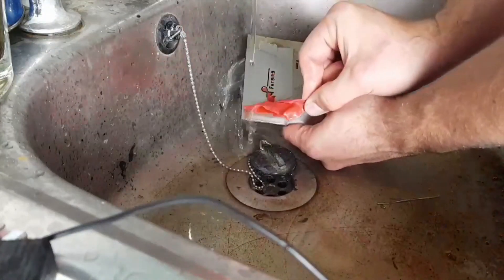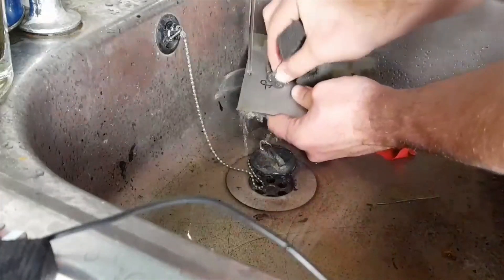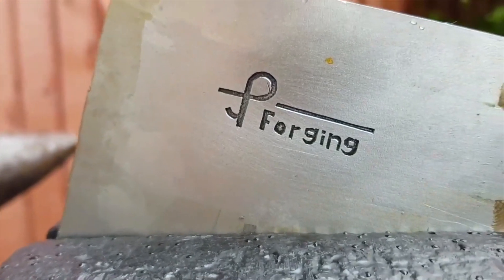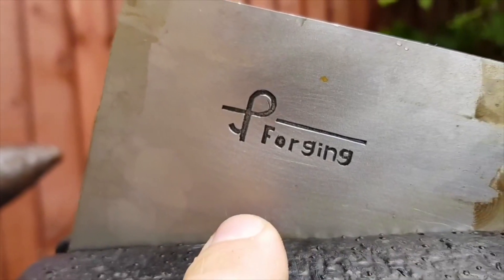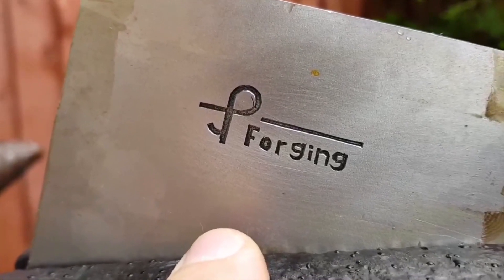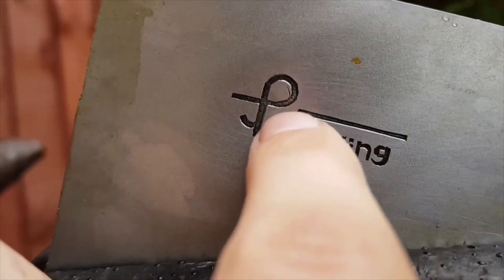I was quite impressed with this — I think it came out really well, considering it was a bit of a botched job. We got rid of the last bit of extra tape, gave it one last clean, and I gave it a quick scrub with some Scotch-Brite. There you have it: one pretty much spot-on example of electrochemical etching. I had originally planned to make the template using a vinyl cutout, but I couldn't find anywhere that would do it particularly cheap, and vinyl cutters are really expensive. For now, I'm pretty happy with how this came out. It's not perfect — there's a little lip where it got under the electrical tape, and the centre of the O is a little bit messy. But for something which has cost me next to nothing, you can't really ask for more. I think that's come out really cool.